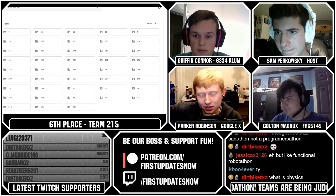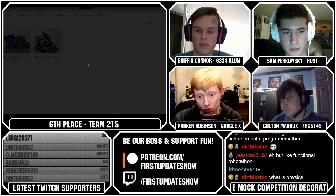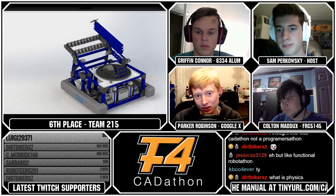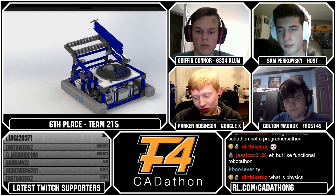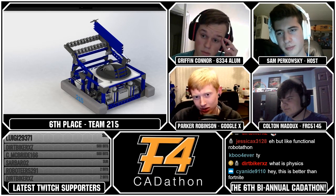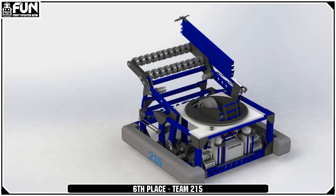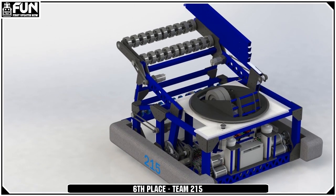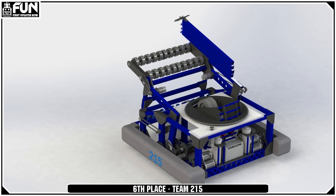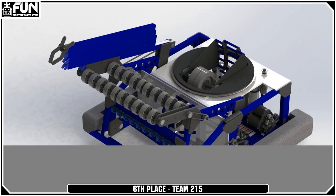Parker: This was a cool robot. The packaging was very nice. The shooter was pretty standard, except they tried to use a differential to control the pitch of their shooter hood. They didn't use a differential right — they pretty much put a gear-based speed reverser inline with their two motors and attached that to the hood. I really like the concept of using a diff for that with the appropriate mechanical design, but the concept felt fundamentally flawed. The star arm didn't seem like it would really work — there was an attempt. But the otherwise great packaging and detail on the shooter and the rest of the robot was solid.